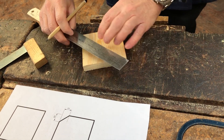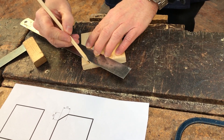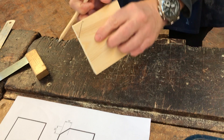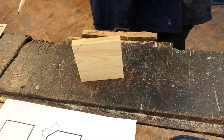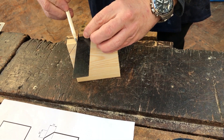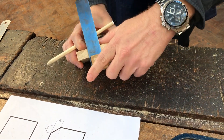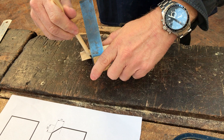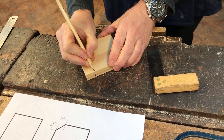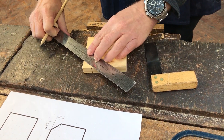You can use the ruler for this — just join those two lines up, like that. Making sure that the line is all the way over. Now, this is a three-dimensional shape, so you can use the tri-square, which is similar to an engineer's square but used on wood. Mark it like that, and then mark it like this. Those lines should then correspond on the other side — just match it up so that when you're cutting it out, you make sure you're cutting it out evenly on both sides.